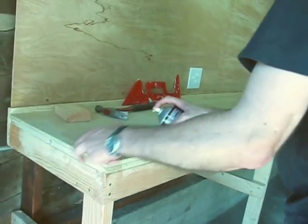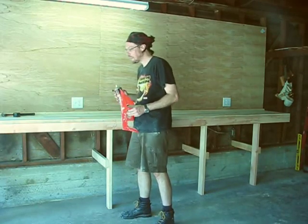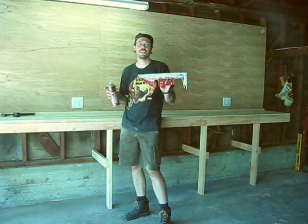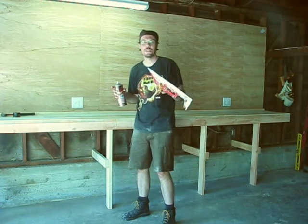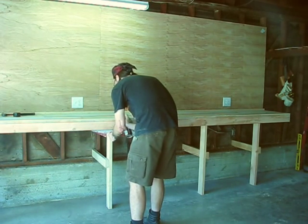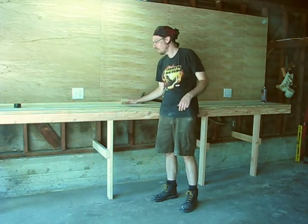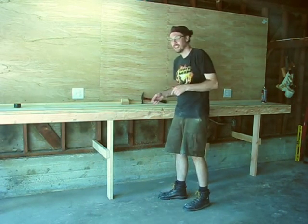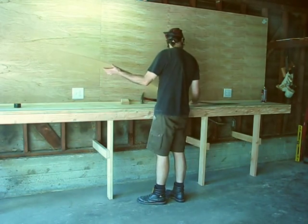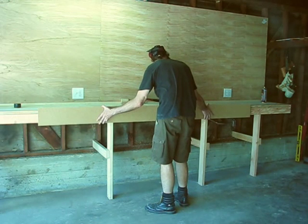You really can't use too much of this stuff. I do want to be a little careful about spraying my floor, so I got this plastic sheet — really made for painting, so you don't paint on the carpet when you do baseboards — and I'm just going to use that to protect the floor as I do this front edge. The glue has had a few minutes to dry. It's pretty dry to the touch, still sticky however. It's called contact cement because it sticks on contact, so you actually just press it against the edge.